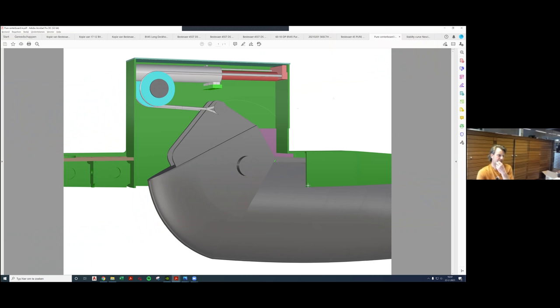And then you service, so this is entirely separated from the hull. There's a Dyneema line that's pulling through that blue pulley. Yeah, the centerboard is on a pivot point, and then we have a pulley here. We have a big hydraulic cylinder here, and this is a line that runs over the pulleys, then continues to the other side. It's one continuous line that goes from port to starboard, so it's a double line port and starboard.